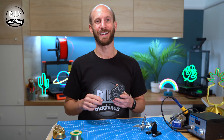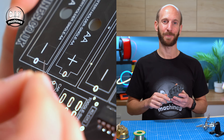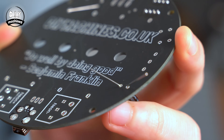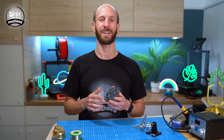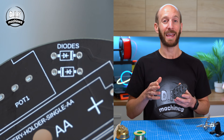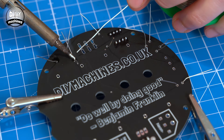After this are our two capacitors. You'll find on these a white stripe and a shorter pin on the side of the negative leg. On the PCB, I've put a little minus sign to show you which side this leg should pass through. Push these through as well and widen their legs on the reverse side, so that they are held into place for now. Following this, you should install the two diodes. Again, the orientation of these parts does matter. If you have a look carefully on the diode, you'll see a small thick black band running around at one end. This needs to go on the same side as the band shown on the PCB. Be careful because the two diodes have this band on opposite ends on the PCB. Once you've added these six, flip the board again and solder the legs. You can then carefully trim these with some flush cutters.